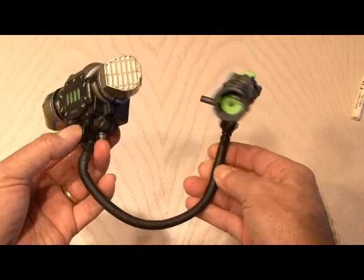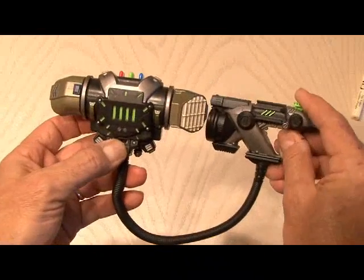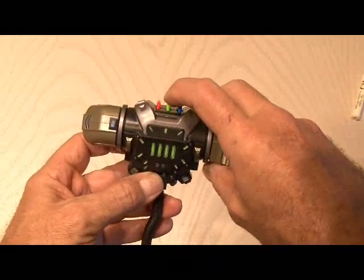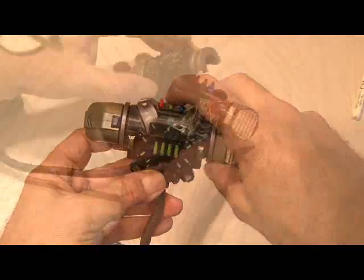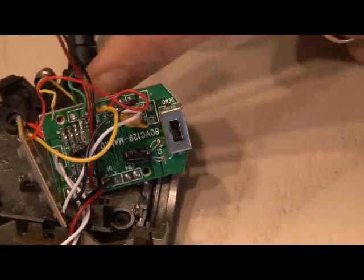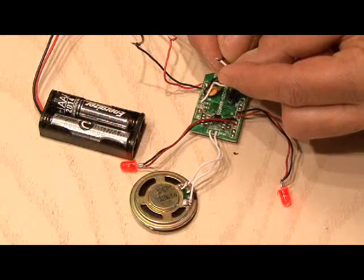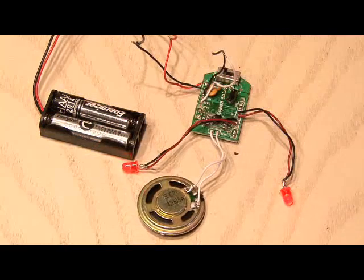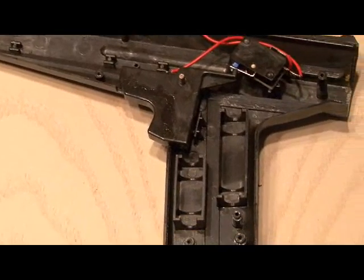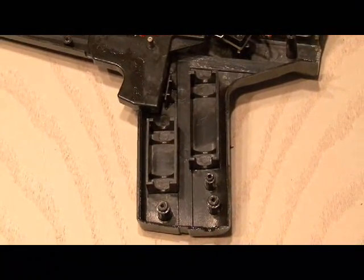Now to add the real effect to our phaser, I found this GI Joe toy which has a great little module inside with a bunch of different sounds. We're going to be using that inside the phaser as we blast our alarm clock. Disassemble the entire toy, leaving just a small circuit board and the speaker. We're going to be adding a twin AAA battery holder, and there are two LEDs but we'll reduce that down to one. We do need to do a little work inside the Sega phaser by cutting away some of the plastic to make room for all the components, so break out the Dremel and get to work.